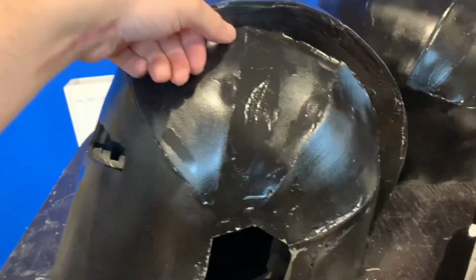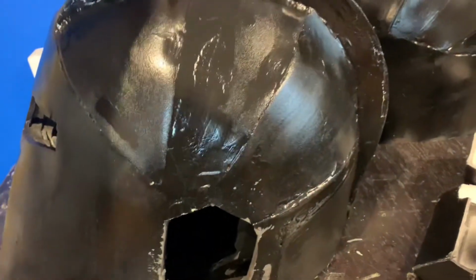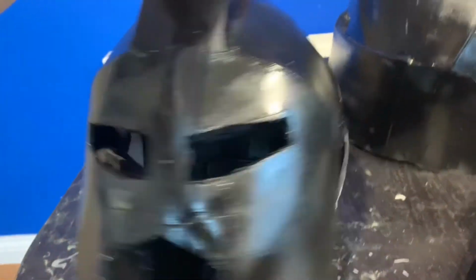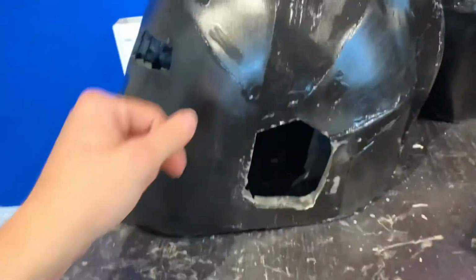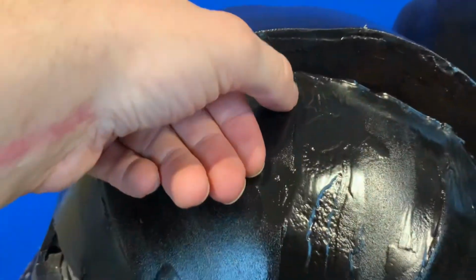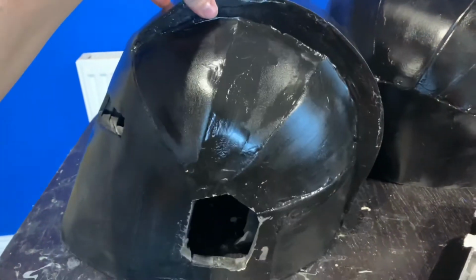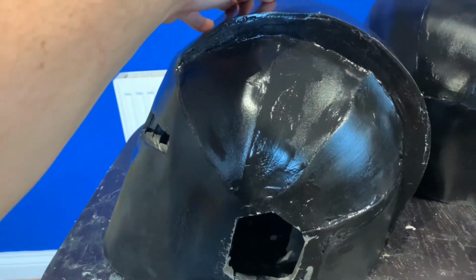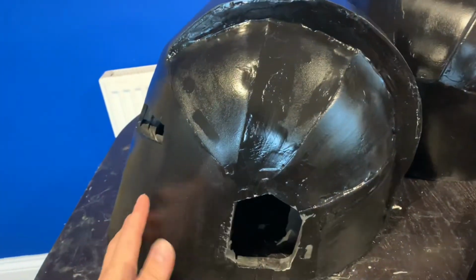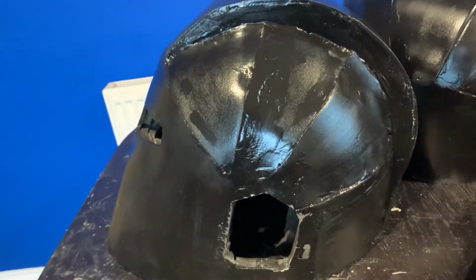what I'll be able to do is have a seam line down the mould, as it will be a split mould in 3 pieces. So you'll have a front half, you'll have 2 sides, and the split line for the sides will be along this line down here. That means if I desire this helmet to be, say, 10, 20 millimeters deeper, I'll be able to just add a spacer in between the moulds and create a bigger helmet.